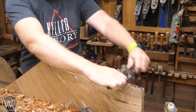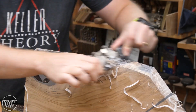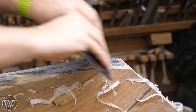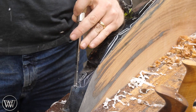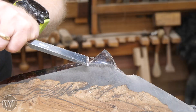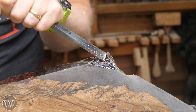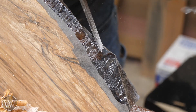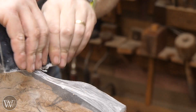Now on the other sections with epoxy, I want to leave the epoxy on there, but I want to clean it out and smooth it out so you don't have the wrinkles from the bag. I want it to be some natural edge and some epoxy so that it filled in any of the big gaps. So I come at it with the chisel to remove the large majority of junk, then bring in the spokeshave and take off a lot of the material, then come in with a card scraper. I could run down it and remove large sections very quickly, leaving a relatively good surface that cleaned up quickly with the spokeshave.